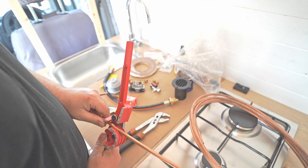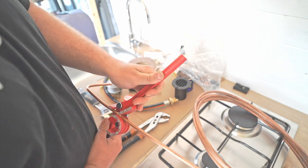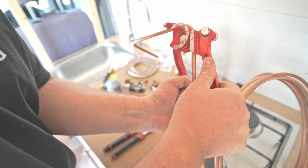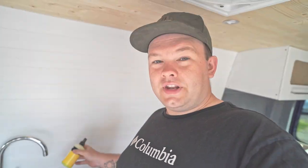A couple of tools you might need for your gas installation: first is a pipe bender — super handy for bending the 8mm pipe without kinking it, especially for tight bends that would be impossible to do by hand. Next is leak detector spray, available from a plumbers merchant. You can also use fairy washing-up liquid mixed with water sprayed on all the joints — you'll soon see any bubbles. And of course you need a copper pipe cutter — I've got a little adjustable one that's perfect for 8mm copper pipe — and an adjustable spanner for the threaded connection.